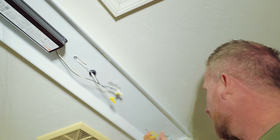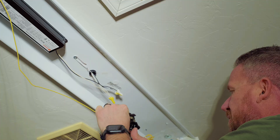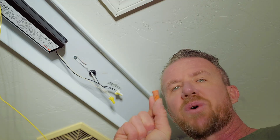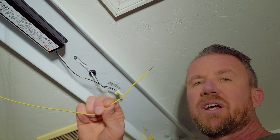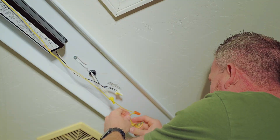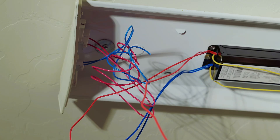Now that we've got our hot and neutral wired in, we'll go ahead and work on the yellow side. We'll pull our extra-long wires over from the other side of the ballast and simply match about where I cut the old yellow wires, then cut the new wires right there. We'll strip off about a half inch with our Klein auto strippers on each of the yellow wires. You'll definitely want to choose the right size wire nuts — if it's way too big, your wires are likely to pull right out. Now I'm simply going to take the new yellow wire and attach it to one of the old yellow wires with the wire nut. Give each wire a tug to confirm they're secure, then wire in the other set of yellow wires.